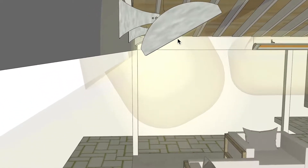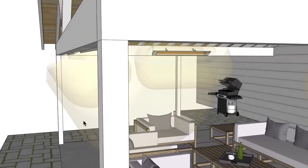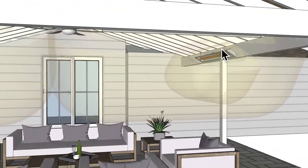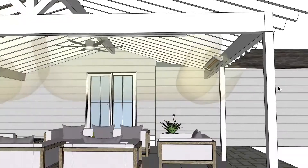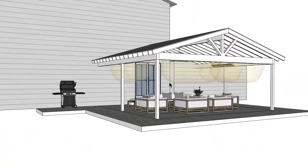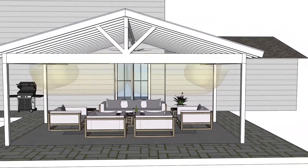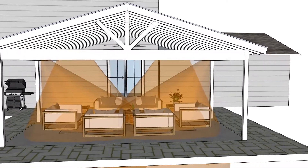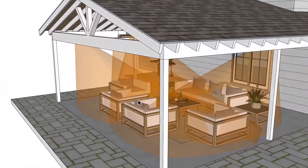You can see that this ray at the 30-degree angle is tilting out, and there's no issue with penetration. They do state it can be on a wall, so that would be fine — clearance behind and above are no issue in reference to the top edge. You may or may not want 30 degrees; you might want to go a little greater, maybe 35 degrees, and I'll explain why as we look at the footprint of heat.